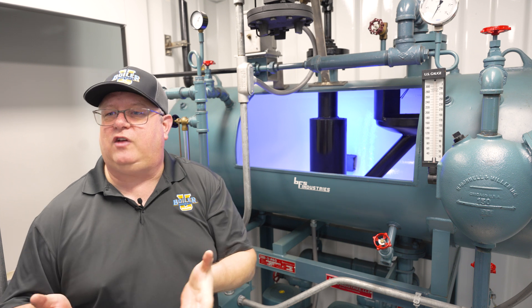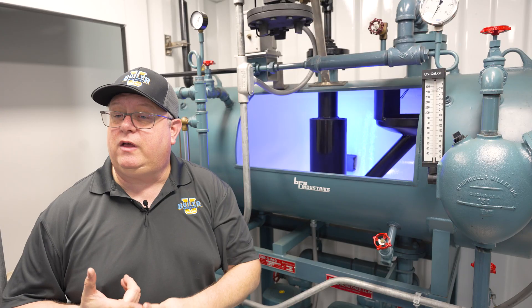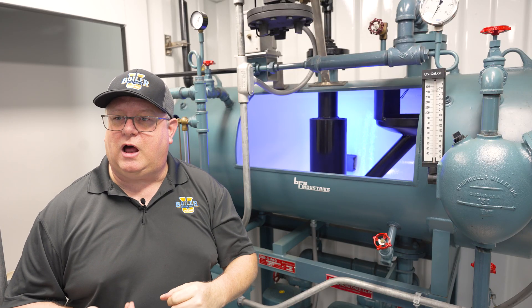When we think about heat exchangers, what's the difference between a little heat exchanger and a big heat exchanger? The answer is surface area. We have a bigger heat exchanger, so we have more surface area to transfer heat. That's really the role of the spray nozzle in a deaerator. By spraying the water in and sheeting it, or trickling it through trays, we're increasing the surface area of the water, which gives us more area for contact between the steam and the water.